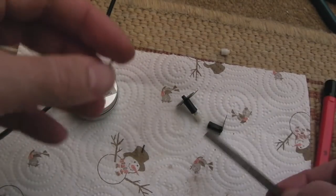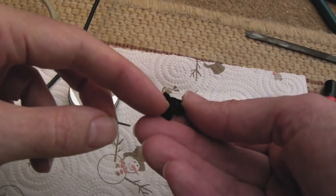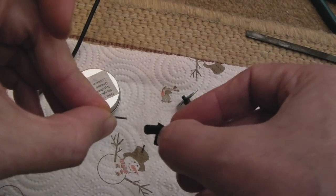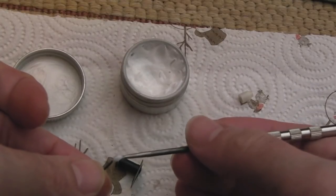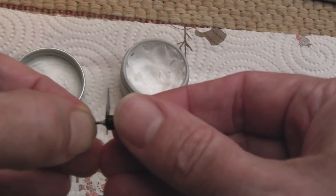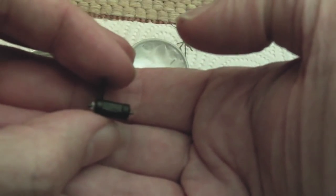So I've just cleaned this - there was loads of corrosion on it and I used the file on it just to make sure it's nice and smooth. What we'll do is get a little bit of molycote, slide the bar back in, and then start epoxying the two bits on either side. So I'm going to stick a little bit of molycote around that and it was this side it came out of. Wow, that's sliding straight in - totally free. What a difference, that's how it should be. Can you see? We've got a little bit exposed here and a little bit there.